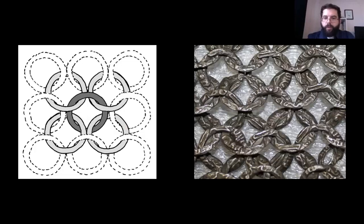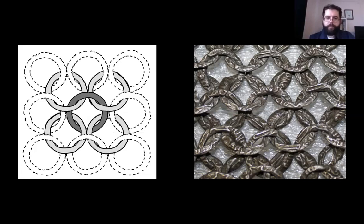The resulting pattern looks like a series of alternating rows. A row of rings may be added or removed to fit the contours of the body, meaning that in some places like the inside of the armpit, there may be only three rings in one or five rings in one to allow the garment to taper. This shirt is made entirely of riveted rings. Riveted rings are made with the ends of wire overlapping; this overlap is then hammered flat, a hole is pierced or punched through, and the two ends are riveted together, sealing the ring. In this shirt, and indeed in most mail from across Asia, the hole is circular and takes a cylindrical rivet. The pliers used to crimp the rivets closed had a concave depression in the jaws, crushing the ends of the rivet into dome shapes that look not unlike a dumbbell in cross section.